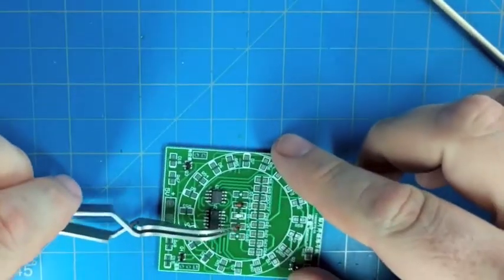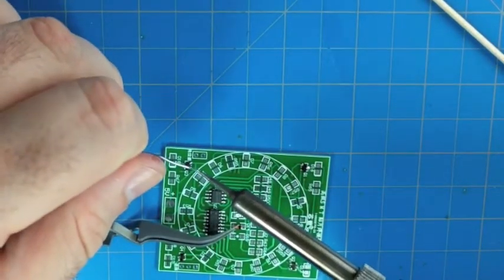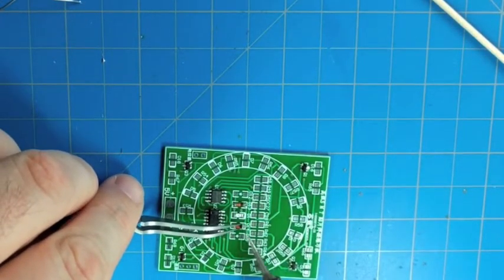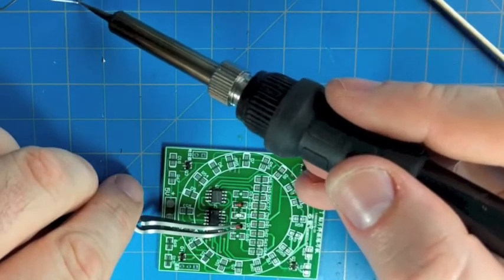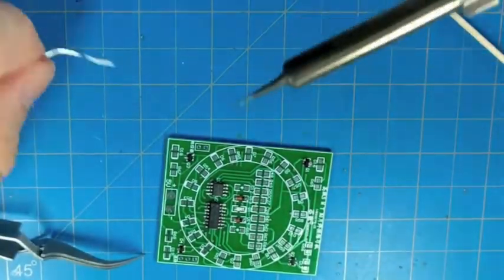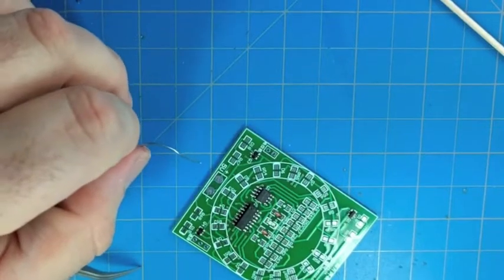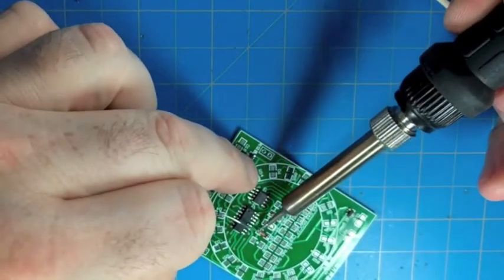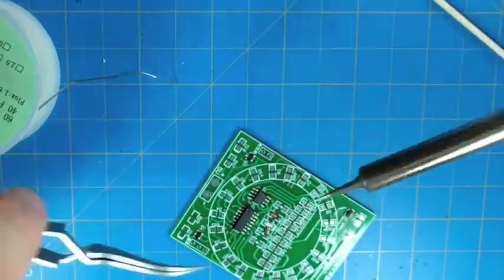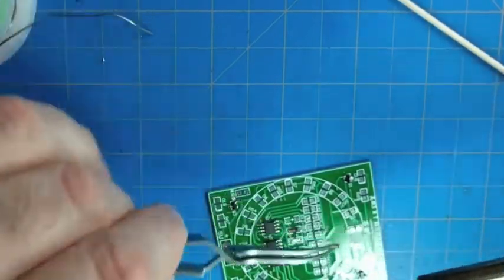And these are a little trickier because they roll, so they're a little harder than the LED was, or than the other rectangular components, because they're a barrel shape. If you hold them in some tweezers, they're big enough you could probably almost hold them with your finger, but because they're round, you can't really stump them with the swab. You also can't just leave them there on their own. So it's a little trickier, but they're not too small. So this is really good practice for doing surface mount. Oh, so sometimes it jumps off. Just take your time and loosen it up and reattach it.